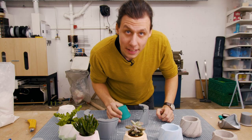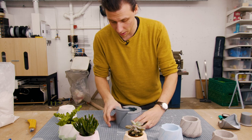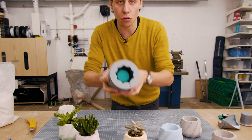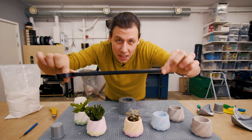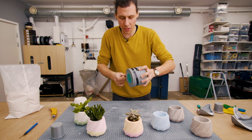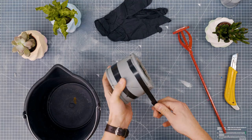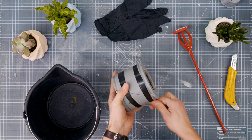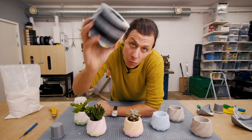It's now time to assemble the mold. The easiest way is to literally just place all the pieces together — they align super quickly. Then using some electrical tape that has a little bit of flex to it, tape the mold together. You don't need to tape all the way around; this is just to hold it together, not to make it watertight. And there you have it — a fully 3D printed mold, assembled and ready to cast into.